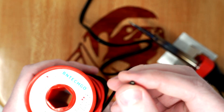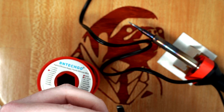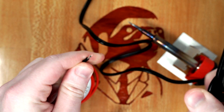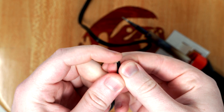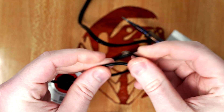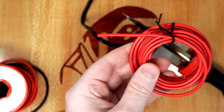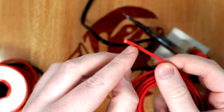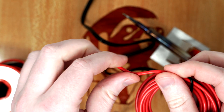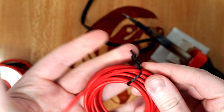It is just hundreds of little tiny strands in there, and you'll be able to see it better if I strip some. It's just hundreds of little tiny strands in there, and that makes this wire super flexible — much easier to build with. That's opposed to the generic kind of stuff at Home Depot. This is the same 16 gauge size but it's stranded with just a few copper wires and it's much harder. It doesn't bend as well, particularly once it has solder on it. So this is terrible, you don't want to use this. I think my first mod had this in there.